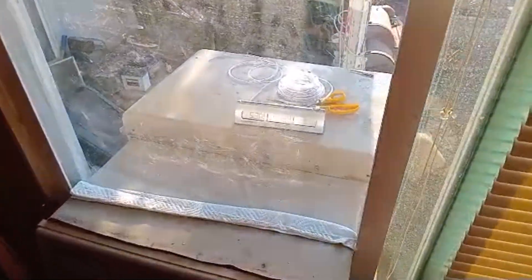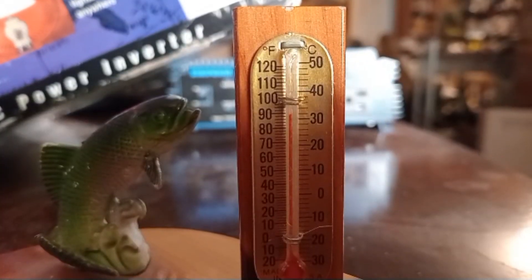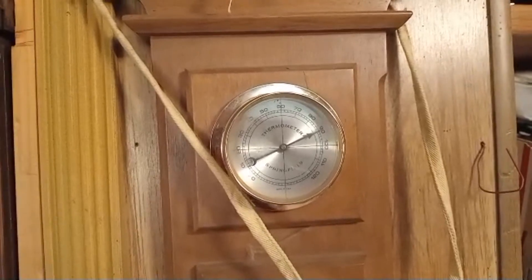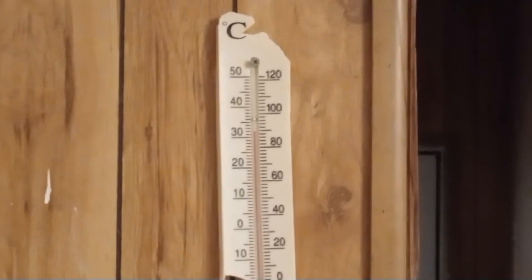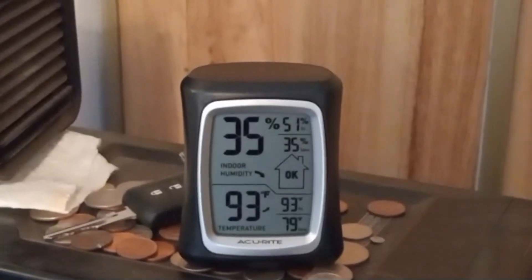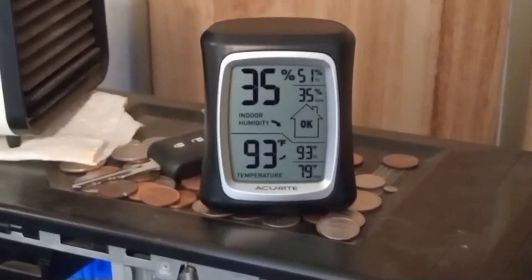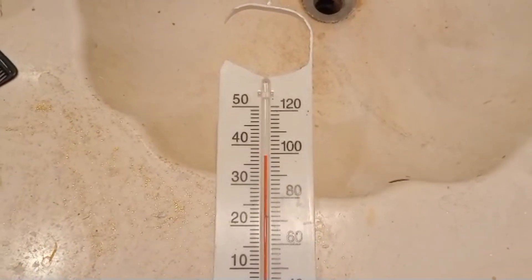It's now 6 p.m. after a few-hour break. It is 111 degrees Fahrenheit outside. The swamp cooler thermometer reads 44% humidity at 86 degrees. Ten feet away from the swamp cooler it's around 90 degrees, and 20 feet away it's also 90 degrees at 45% humidity — it's actually feeling a little bit dry. At the far end of the house it's 90 degrees as well. In the bedroom it's 35% humidity and 93 degrees — pretty warm. The room without cooling is about 100 degrees.